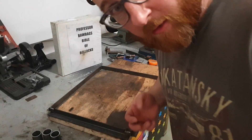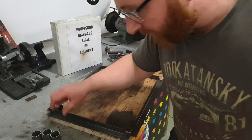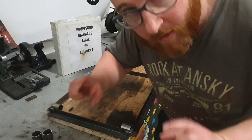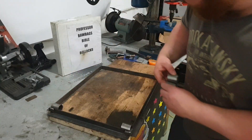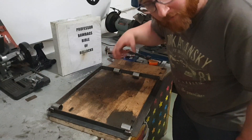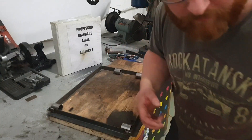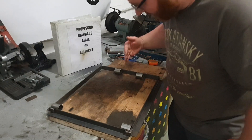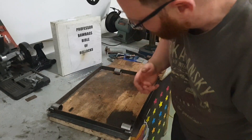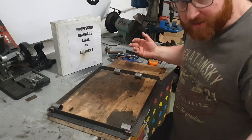That's one fully squared off and assembled jig. Next thing we need to do is work out where all of our bush pickups are going to go. On the rear lower there are basically four bush pickups, whereas on every other arm there's only been two that attach it to the chassis. On this one there's going to be two that sit here, and the hub's going to be sitting in the middle of that with the bush being the pivot point. Having looked at the plans, it's a 91mm gap from the centre line, which means it'll be symmetrical — we can use the jig twice. I need to put a couple of plinths in to locate them, and then our jig is ready.